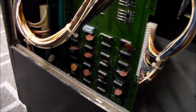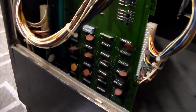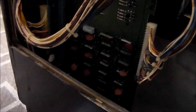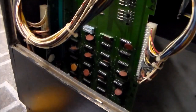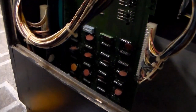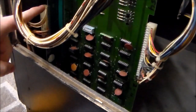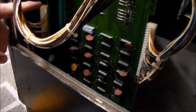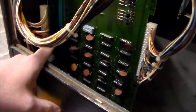I went and wrote down the voltages I'm supposed to have. This is the edge connector that provides voltage to the PCB. When I turned it back on just now I got some gibberish on the screen where it was resetting, and then it went off to where there's nothing on the screen. On this connector, the first wire is white and that is your plus five, and all of your grounds are down at this end — you can kind of see the big pad on the PCB.